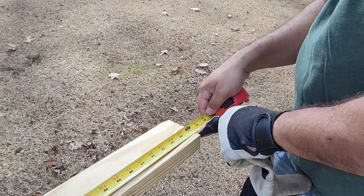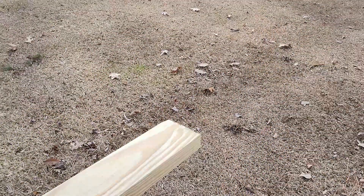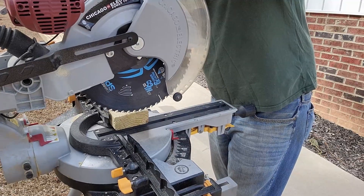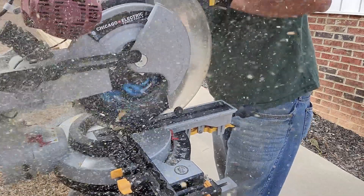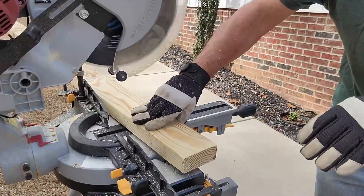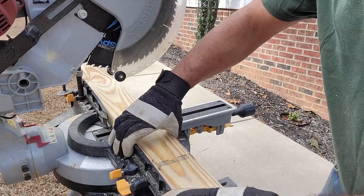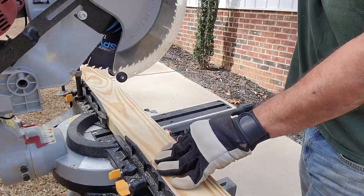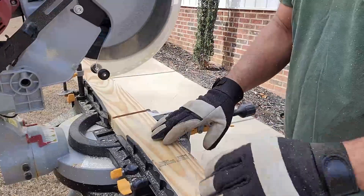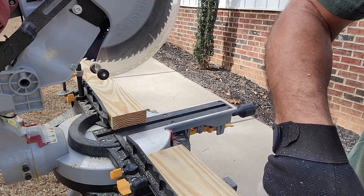You're not saving a lot of money — maybe 50 cents — but it adds up. Something I try to do is measure the two-by-four first to see how much the board was over-cut, and that lets me know how much of the ends I can trim off before cutting it into smaller pieces. It's important to remember you're working with rough-cut lumber — the length tends to be roughly cut. Sometimes you get exactly eight feet, sometimes eight and a quarter, sometimes eight and a half, so never assume you have exactly 96 inches.